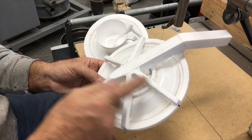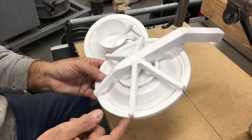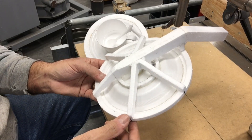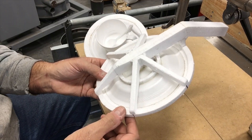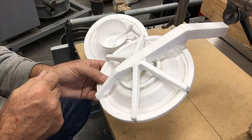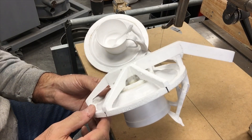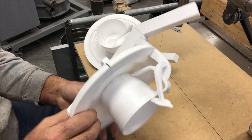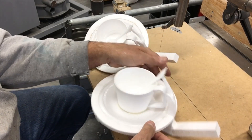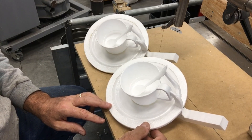I'm hopeful this will get the plate to fill reliably, but we'll see — there are trade-offs because I've got to evaporate a lot more foam getting my way to the actual plate. All this foam and the ring gates have to be evaporated by the metal, and it's going to be losing heat that whole time. But hopefully this big sprue and pretty generous fingers will get it out there in a hurry and it'll still have enough heat to do the job. If that doesn't do it, I think I'm probably out of bullets on that.